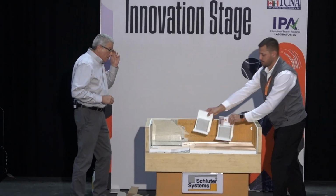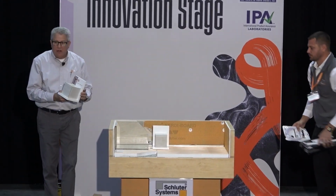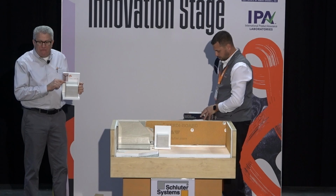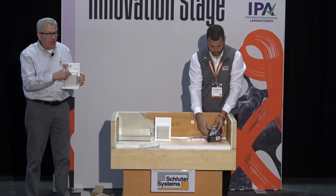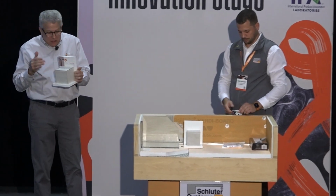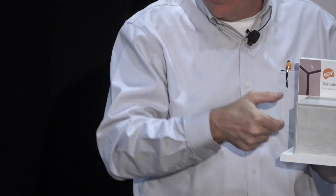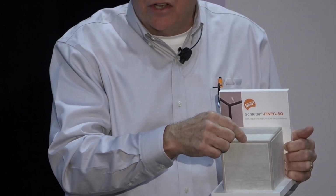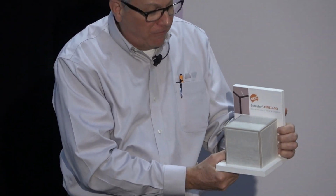All right. You might not be familiar with this profile, or maybe you will. We've had a profile out for a while called a Finec profile, and the reason we use the Finec term is because it's a very fine little profile. It doesn't take up a lot of space, you don't see it a lot, and it really blends in. The nice thing about the Finec is it didn't matter how thick your tile was or how thick your bond coat was under the tile. This is always the size of the profile, regardless of what the tile size is. So it makes for a very unobtrusive, small, fine line to finish that off.